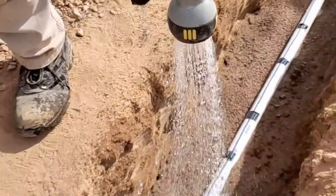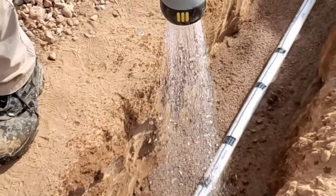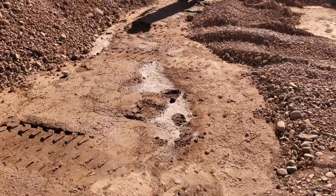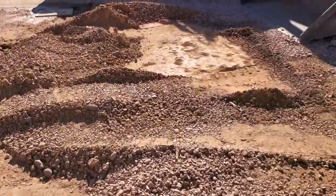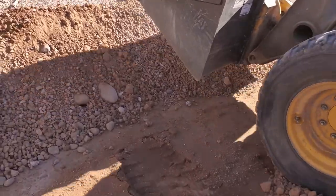FYI, if you have to do more than six inches of backfill in your project, code states you'll need to break it into layers. After dropping in six inches of backfill, each layer has to be compacted. You're essentially making sure the backfill isn't too loose, preventing a sinkhole later and possibly avoiding damage to the line from uneven backfill or shifting.